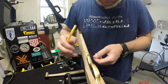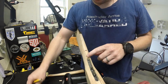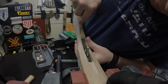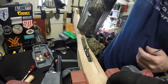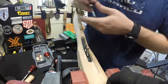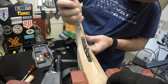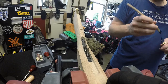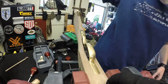I might just do just a little bit more. I've traced around this, and from this point I'll go ahead and shape the brass to make it a little bit more smooth and squared up, and then I'll use the inletting tool to inlet the rest. Everything else should fit in there after that. Looks like we've got it fit in there pretty good - time to mark it and drill it.